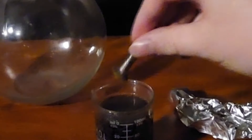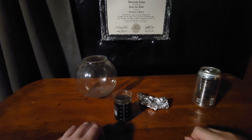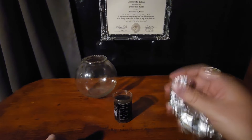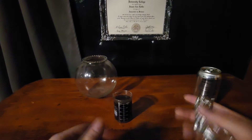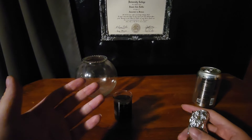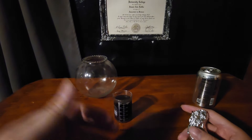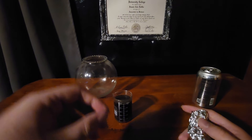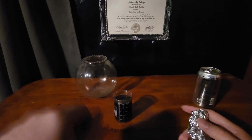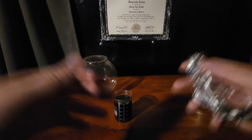So I'm going to place the screw in here and let it soak for a little while. I have some aluminum foil that I just balled up that I'm going to use to scrub the rust off. Why scrub if I'm doing a chemical reaction with phosphoric acid? Well, the phosphoric acid doesn't burn the rust off. What it does is convert the iron oxide that the rust is made of into ferric phosphate — or iron phosphate — which is still on there but is water soluble, so it's easier to clean off. It's a little weaker so you can scrub it off more easily than plain iron oxide.